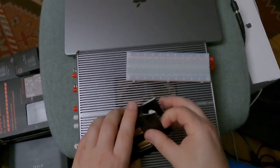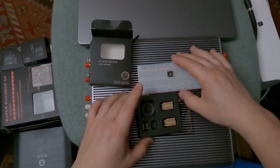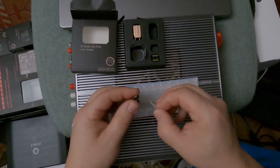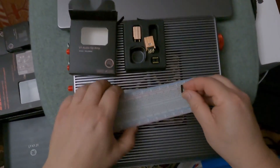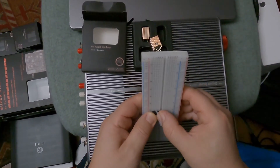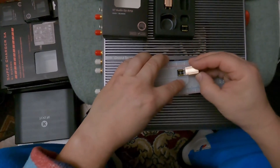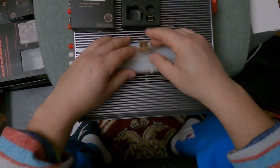The package coming with V7 Pro op-amps contains a couple of gold-plated DIP-8 sockets and rubber or silicone o-rings. These accessories are for hobbyists using V7 Pro op-amps in their do-it-yourself electronic circuits. Before soldering the DIP-8 sockets on the board, the o-ring needs to be placed first, then the DIP-8 socket follows, and finally the V7 op-amp is inserted on top — the o-ring will surround the op-amp to keep it tight in place. I'll use a protoboard to demonstrate the usage of these o-rings.